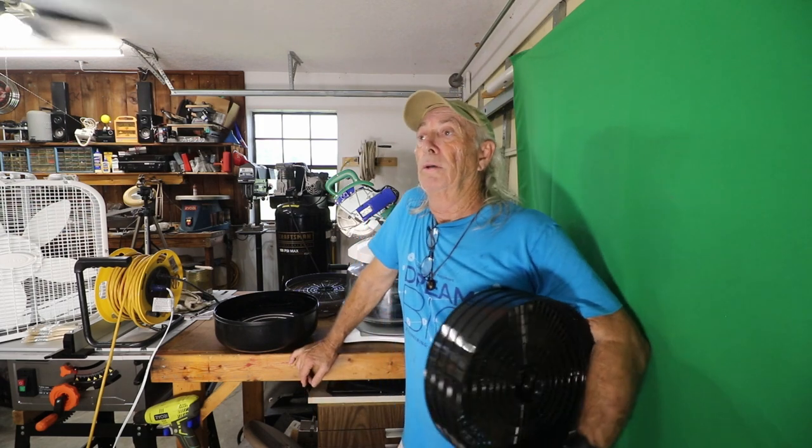If somebody came out with something almost static like that — just a light bulb in an insulated box, close the door — it would keep everything dry. You could stack all your filament spools in there, keep them dry, and when you're done printing, put them back in the dryer for storage. A small low-wattage 15-watt, maybe even LED bulb might do it. With the old refrigerators we used for welding rods we didn't even vent them — we just put a light bulb in the top, put all the welding rods in the bottom, and it kept moisture away so you always had fresh rod ready.